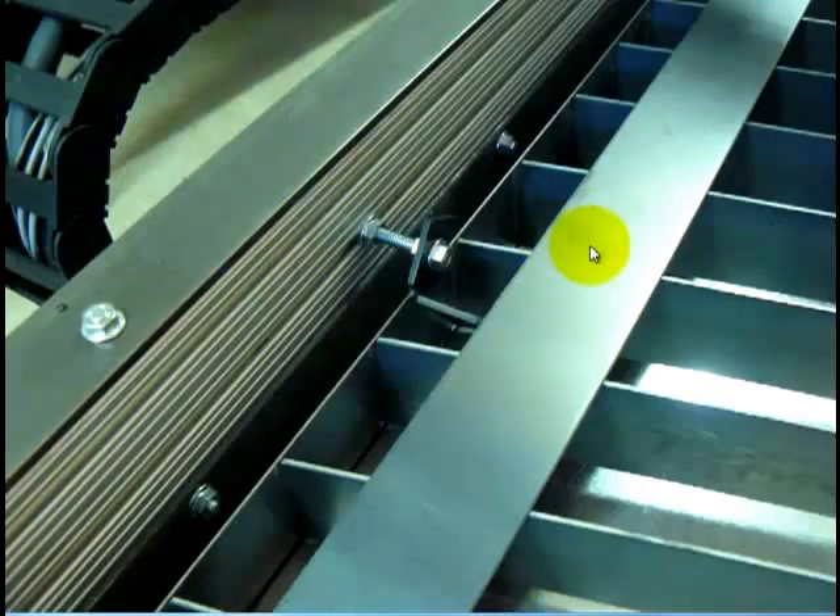One little feature recently added: these material stops. You'll find these on either the right or left side of the machine — there will be two of them — and they can slide along this slot anywhere along the side of the machine, then be tightened down and adjusted in and out. When you lay a piece of material down, you can simply slide it up against this stop and it will be in line with your cutter, so you don't have to manually line up your sheet. This stop also twists so you can set it just above the material surface, which decreases the likelihood of hitting it with the plasma cutter when cutting close to the edge.